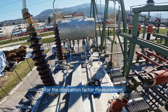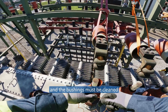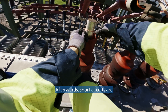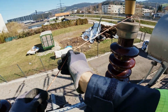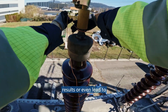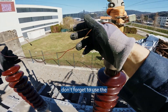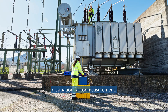For the dissipation factor measurement, all cables and connectors have to be disconnected from the bushings, and the bushings must be cleaned beforehand, as unclean bushing surfaces could affect your measurement results. Afterwards, short circuits are mandatory on both the high-voltage and low-voltage side. This short circuit is to avoid an open main inductivity, which could influence the measurement results or even lead to unsafe voltage on open terminals. When connecting the high-voltage cable, don't forget to use the strain-relief mechanism, and with this setup done, you can now perform the dissipation factor measurement.